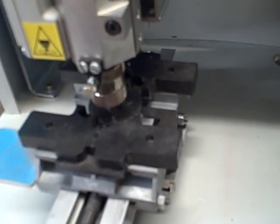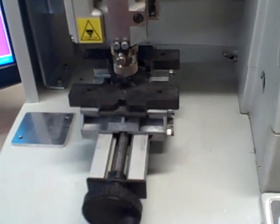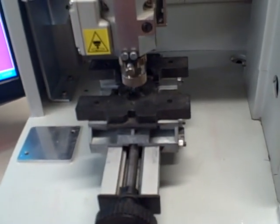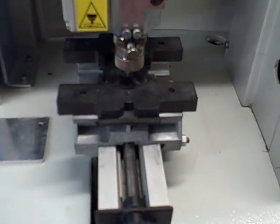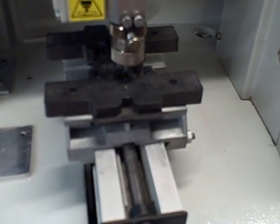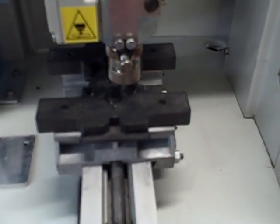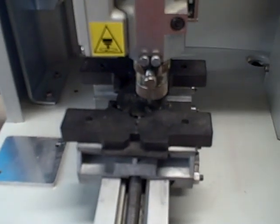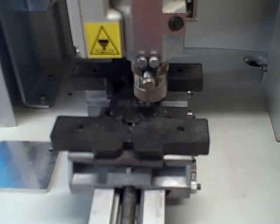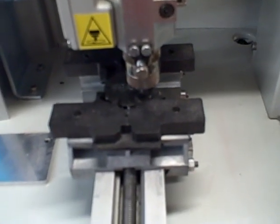You'll probably see the machine, once it comes down, it stalls for a second. That's called a dwell time. Dwell time is used to make sure that the engraving bit is at its full depth when it first makes the engraving. If not, it looks like you ramped into it and it's not clean. So by going down and staying there — called a dwell — it will give you a much finer engraving. It takes a couple of seconds longer but your engraving quality is much much higher.